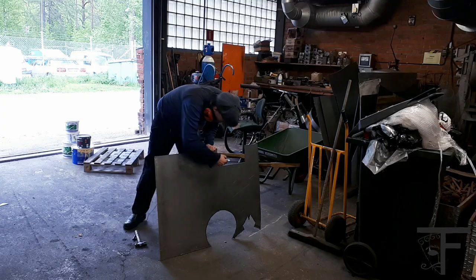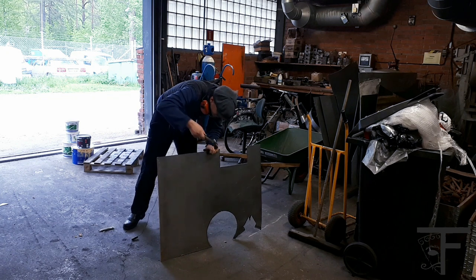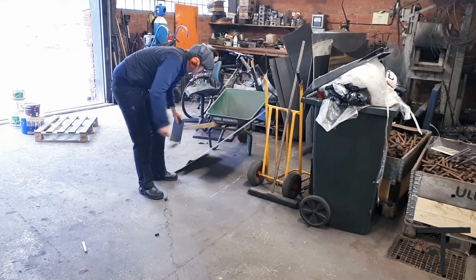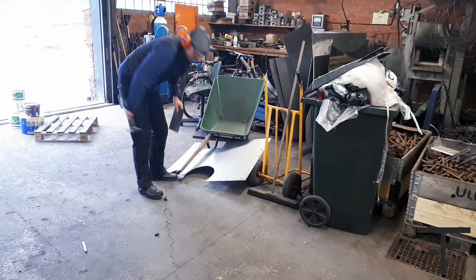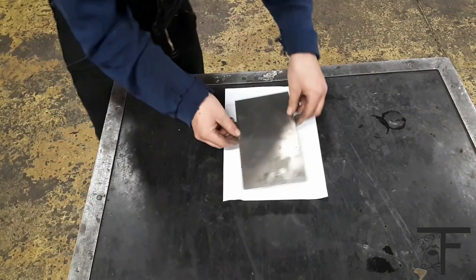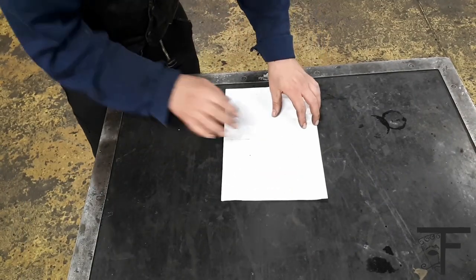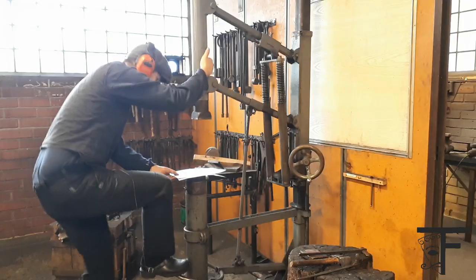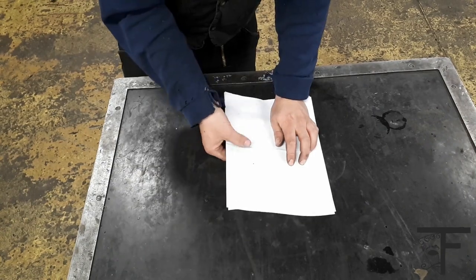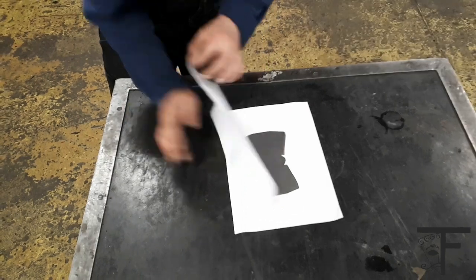Cutting. So, cutting a plate, you take a pen, mark the place you want, and a little hammer. There we have it. Cut out all the corners, you can use a scissor and a file around the corners. It takes too long, so what I do is put the piece over clean paper, and under the hammer. Let's see. Need one more hit. Going down and... There we go.